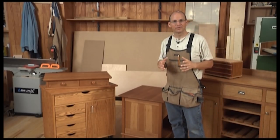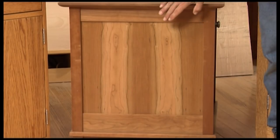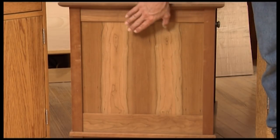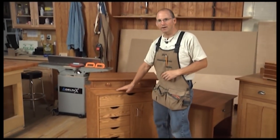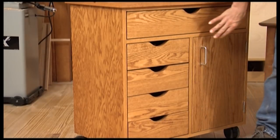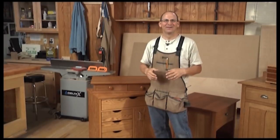We've looked at how important it is to select hardwood for your project but plywood is also key. In this nightstand we selected a cabinet grade material and carefully centered the grain within the frame — it adds real drama. In a more utilitarian piece we selected materials available from the home center with rotary cut plywood. It was less expensive but also yields a successful project. So let's look at some of the tips and techniques we use at Wood Magazine that you can use in your shop.